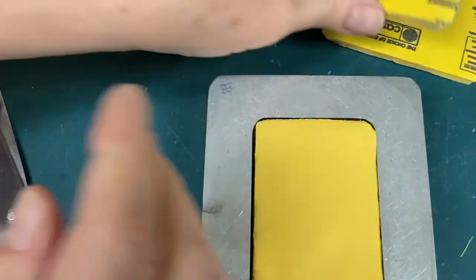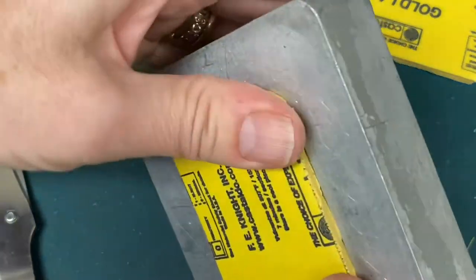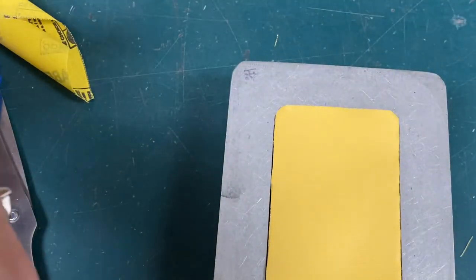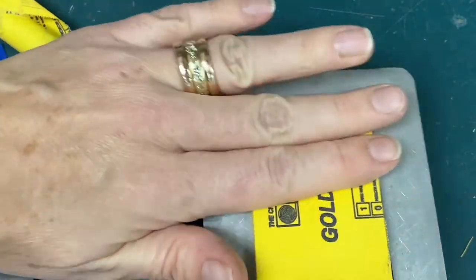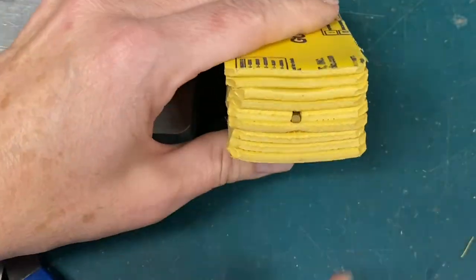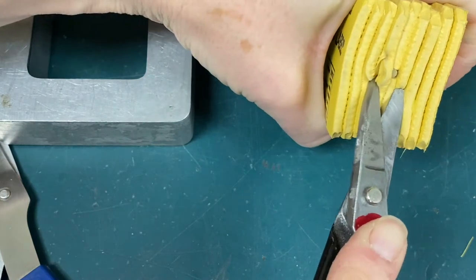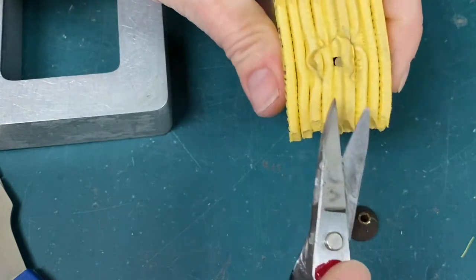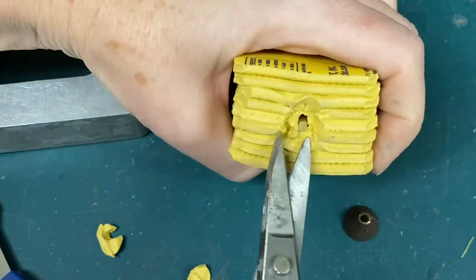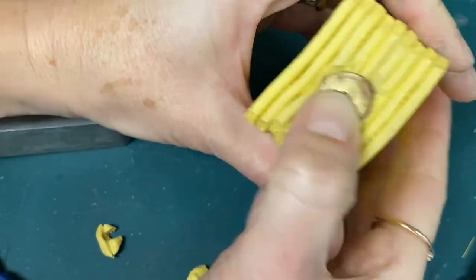Once it fits in well with the two extra layers in place, if you did not insert your cone yet, take the whole mold out. Use solder snips and just plunge and snip all around the sprue — that creates a space for the cone. Push the cone in tight, fit it into the frame, and it adds a lot of pressure and helps solidify everything nicely.